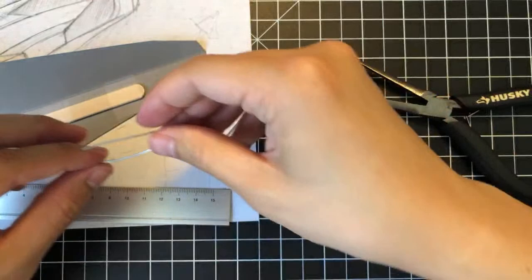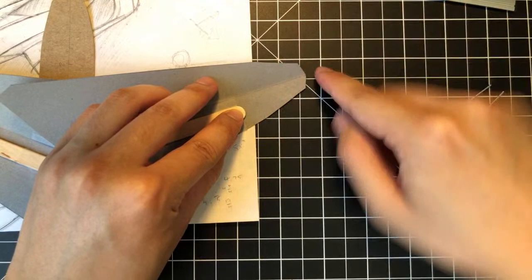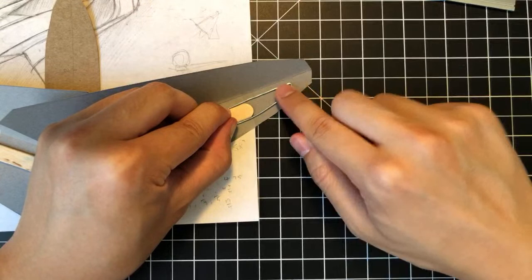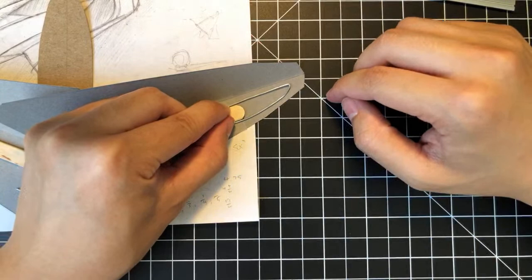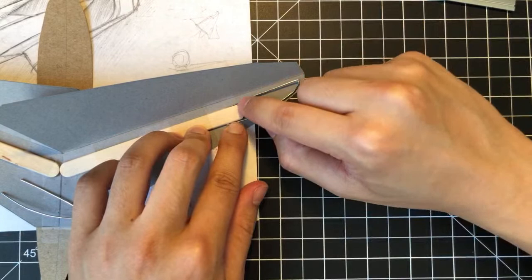Like I said before, a couple of minutes ago, I could lay it out as an offset of the leading edge, lay it out as an offset of the wing tip here, and really, really go deep into that. But I don't want to do that for this rapid prototype, so a general shape will suffice. This is just a structural thing for the winglet, which shouldn't even experience too much load if it flies properly and doesn't crash on the wingtip. But we will see how this goes. How much to extend this is a good question, because that depends on how well we can secure the inner side of this.